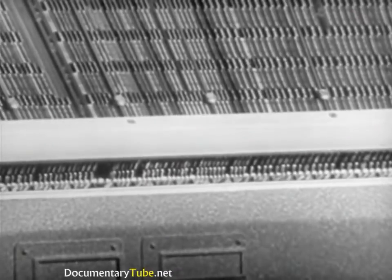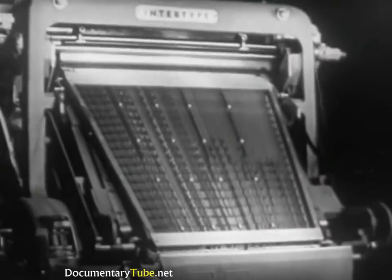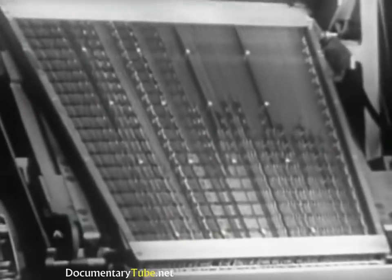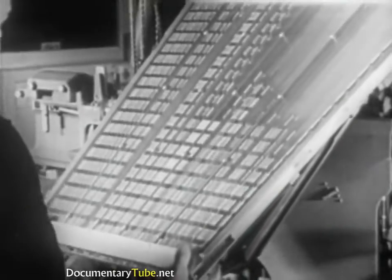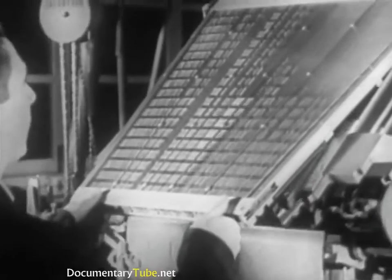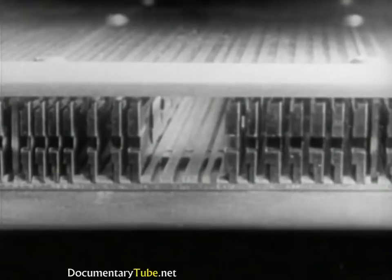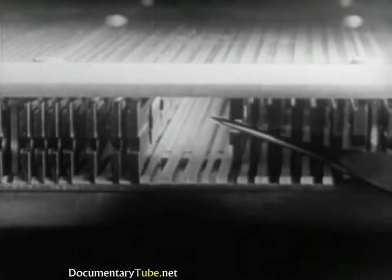The mats that come out are arranged in the magazine situated at the upper part of the machine. It rests in a slanted position to facilitate the descent of the mat. It is substantially formed by two trapezoidal plates, one below and one above, which can be made of visalite. On the inside of the magazine, there are grooves called channels, which support and guide the circulating matrices.